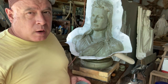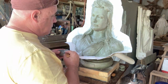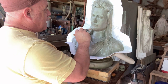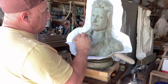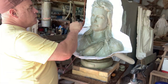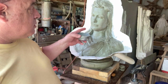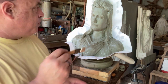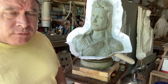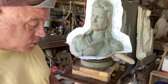And that isn't something you do with marble. That's only with stone. That's only when you axe a stone with tools. And so this is what I say about using some of the fancy ornamental stones that don't close up well, is that you can't mute that impact. But by doing round on her chin, having her nose straight, having the flow like this across her cheeks, you will understand how the tool marks need to go when you cut it, so it looks good. Because you can see on here that this makes her look all bright, happy, and pretty. And if I went straight across or up and down, she'd look either very fake or she'd be all angry and a whole different demeanor. And that's the kind of small detail that's really different with granite versus other stones.